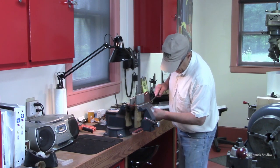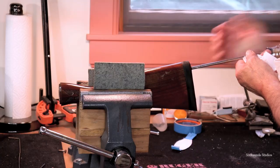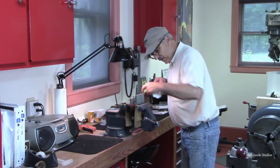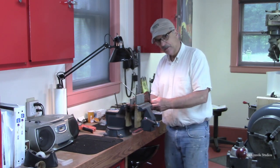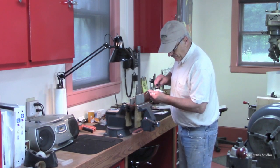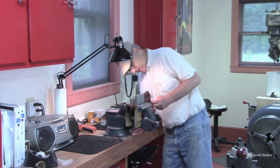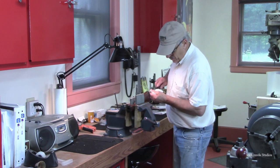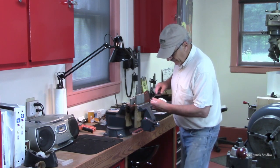this is early summer, and the humidity has really just started. Depending on where the gun gets stored, the wood will absorb moisture throughout the summer here in New England. So the wood will actually swell. It'll grow, it'll get bigger. And my theory is that the wood will actually grow to the pad. Again, I've only left about 2 thousandths plastic over the wood.